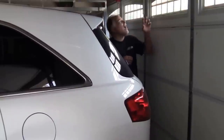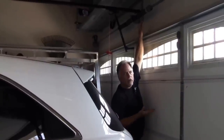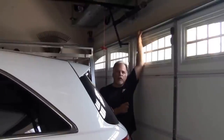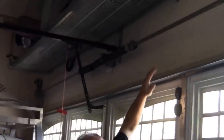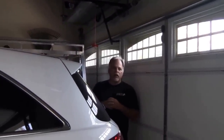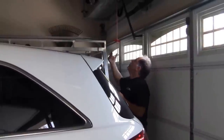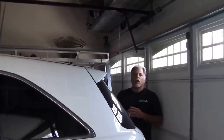If you have a two-spring system, you still have this spring here providing 80 pounds of lift to help you lift the 160-pound door. A lot of less expensive doors come with a single spring — if that single spring breaks, the door is stuck down, the drum loses all tension, it rolls backwards, and the cables come off. It's a lot harder to fix a single-spring door, especially when you want to get the cars out. So what we're going to do is re-secure the operator to the door and lift the door to get the cars out — that's step one.